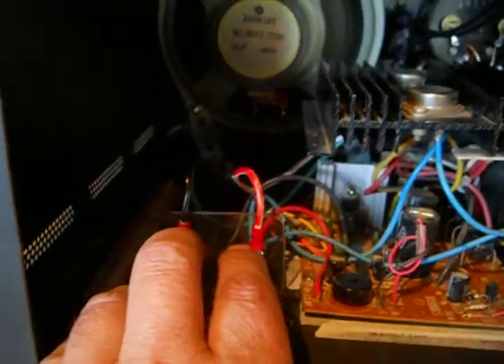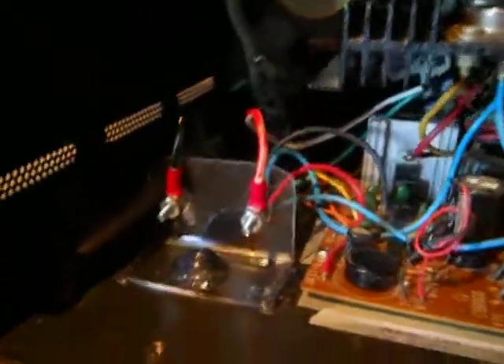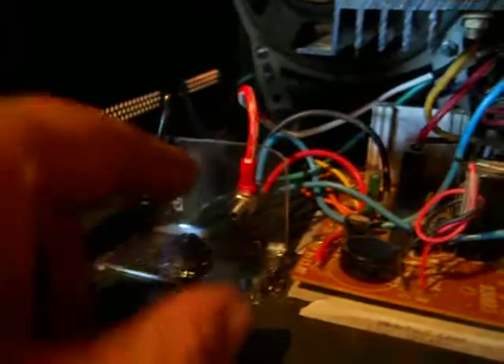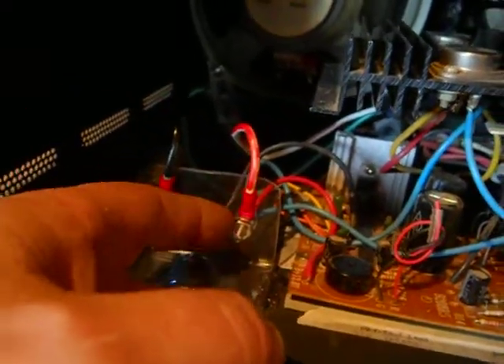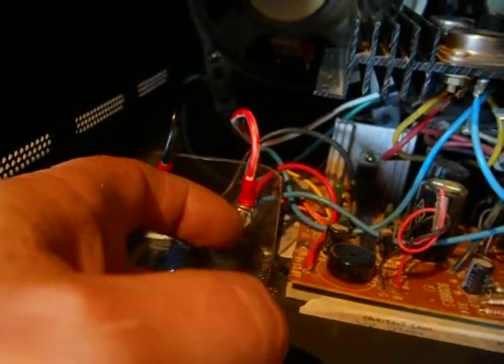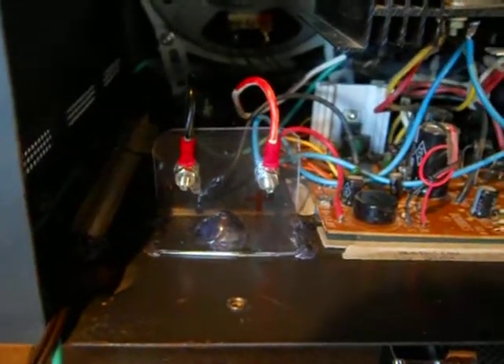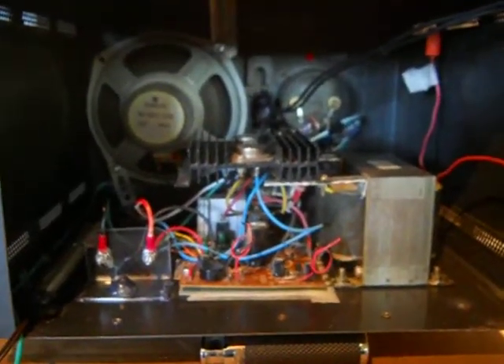I have plenty of star washers — I have star washers in between, I've got double the star washers. They're internal tooth washers. I have one on either side of the connector so I don't have to super-tighten everything. Those are just number six machine bolts — machine screws. When they get down nice and small they call them a screw, I guess. But that's it for this part — thanks for watching.